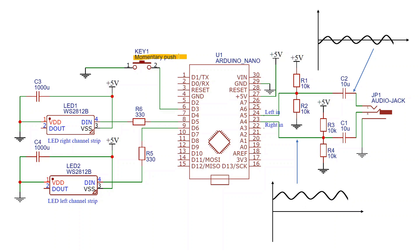In the code I've set up a pull-up resistor, which means that normally pin D3 is connected to 5 volts, but when this button is pressed, D3 is pulled down to ground and that registers an input. The data in for the LED strips are attached to D5 and D6. I'm using WS2812B LED strips here, but any 5 volt strips of a similar type should work. The data pins are connected via 330 ohm resistors, which reduces the current from the digital pins and cuts down on noise.